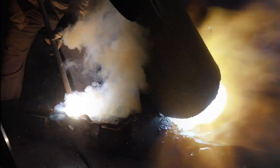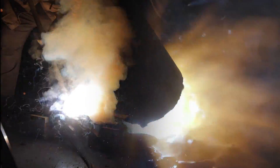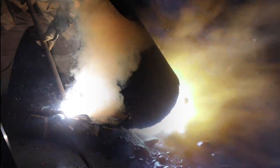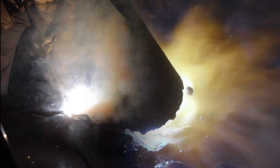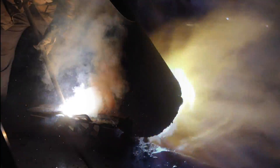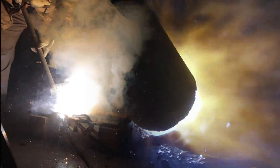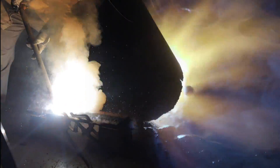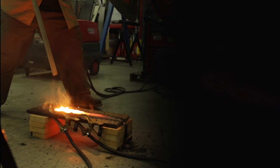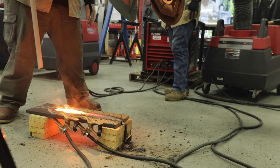It's a mechanized process and we're running it manually, so we'll take that into consideration as far as weld quality. This stuff runs pretty smooth and is very fluid - you can actually see the spatter coming off, it's the size of small shooter marbles. We've got three fume extractors running to pull off the fumes and it's probably still not adequate. Thanks again to ReadyArc for loaning us the DC 1000 and the generator - visit ReadyArc for all your rental needs. I can't wait to see what the penetration profile looks like - I bet it goes halfway to three-quarters through.